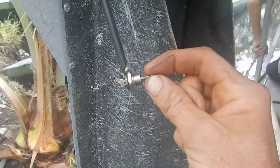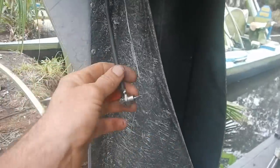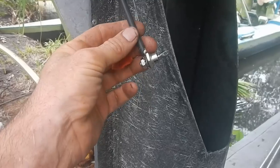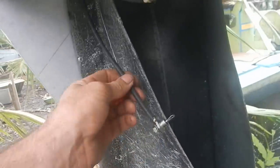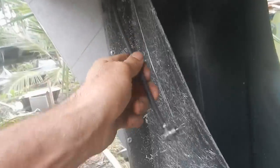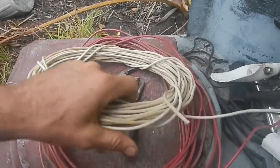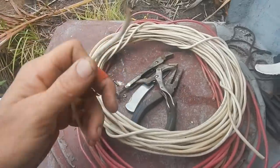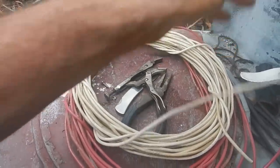I have to attach my negative to here and it's going to go all the way back across the ceiling down to that switch over there. And the other thing I need to figure out is how I mount this in a way that's not going to move around. The negatives on this boat will be white, because that's what I have in 10 gauge, and I decided to go with the 10 gauge not the 12 gauge.